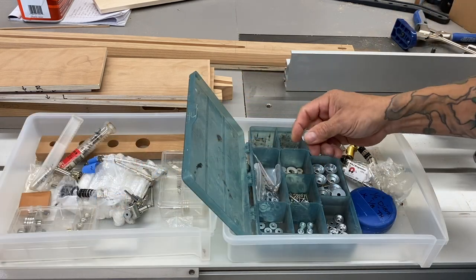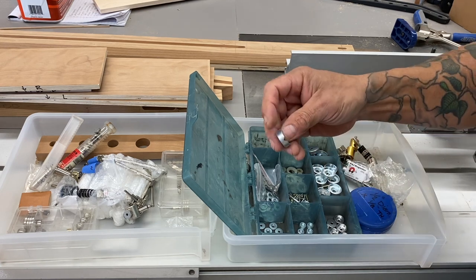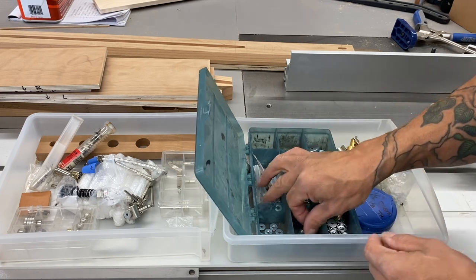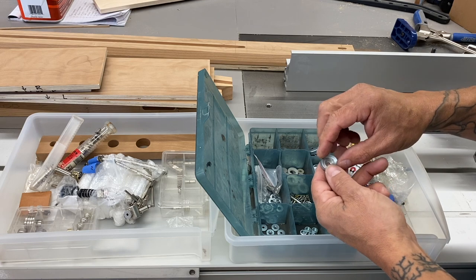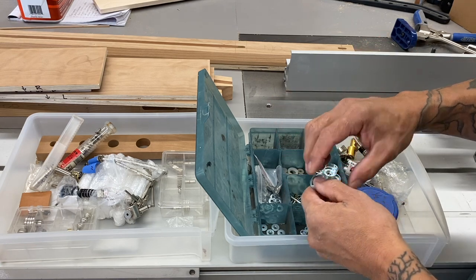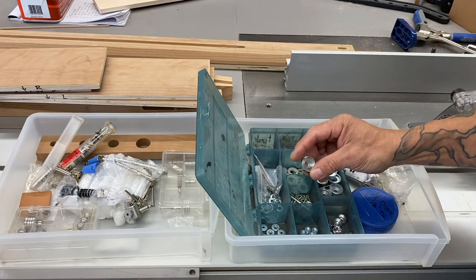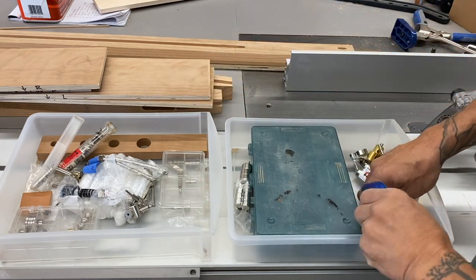Here's some square magnets — kind of cool to experiment with what works and what doesn't. Magnets with holes in them — these are cups, designed for magnets. I'll just make a notch with a file, and then you can use these for tests. You'll bore a hole this size, the magnet fits in there, and you can bore a hole, screw this inside, slip a magnet into it, and do your test. If it doesn't work you can access the magnet through that notch, dig it back out, and use a different size rather than gluing it in.